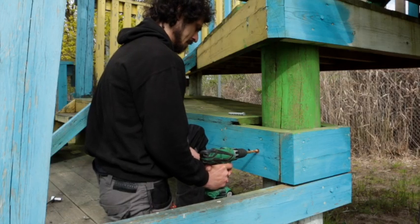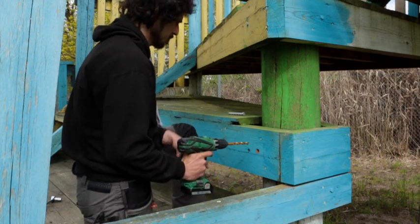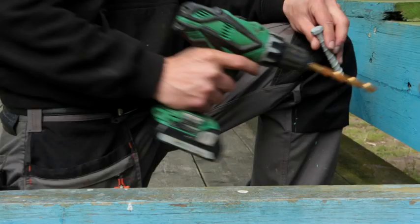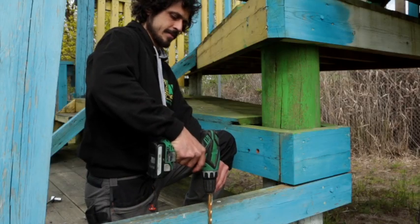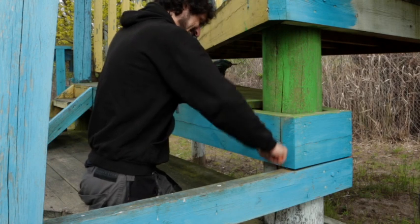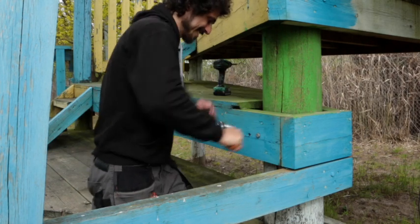Let's have a go at installing one — it's quite straightforward. First, drill your pilot hole. Remember, with the modern bolts, the drill bit size is the same as the bolt diameter. Drill an inch or so deeper than the length of the bolt. Second, screwing the bolt: this is best done with a ratchet set, but a simple spanner will also do the trick.